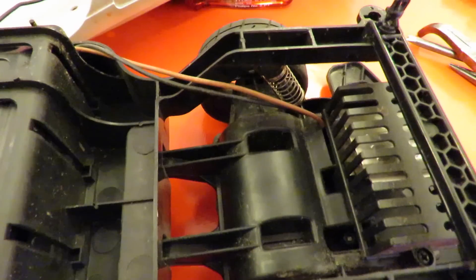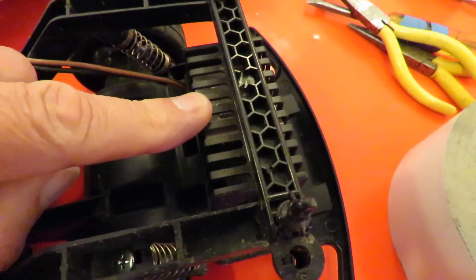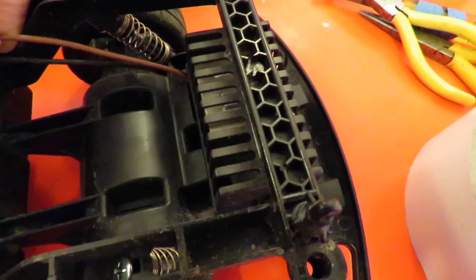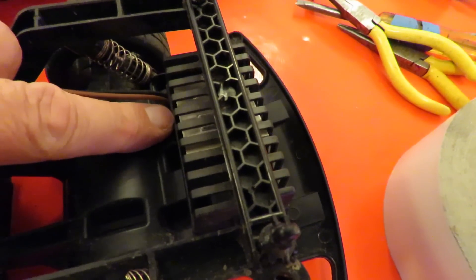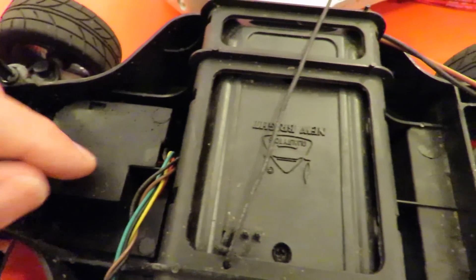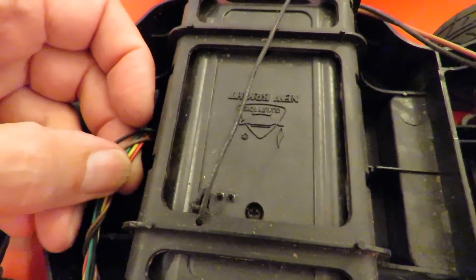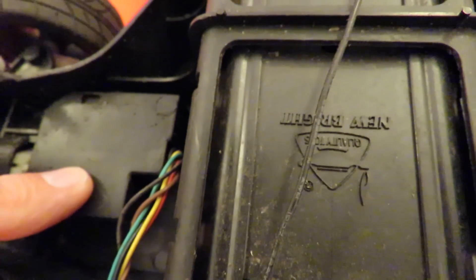Just before I put the cover back on, there are a couple of things we can say about the car. It's going to be a brushed motor — definitely not brushless — because it's only got two wires going to it. If it was brushless it'd have three, unless it's got some sort of onboard controller, but that's very unlikely. So I would say that's a brushed motor in there. And then at the other end, the steering motor — you'll notice there's six wires going into the little box that's got the motor in it.